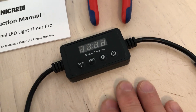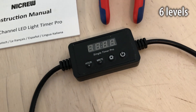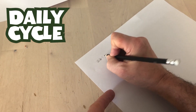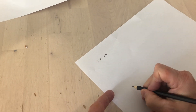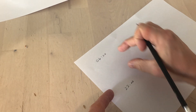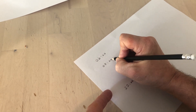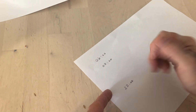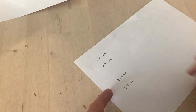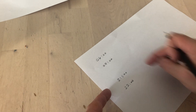For each one of these modes, you can set up to six different levels. Each level has two things: the time of day and the brightness. Say at 6 a.m. we want the lights to come on, and at 10 p.m. we want them to go off — that's 16 hours. We want it to get slowly brighter to about 7 o'clock until it reaches full brightness, and that continues all day because I want to look at the tank during the day and don't want it to dim early. So we'll have a big block of bright light in the middle.